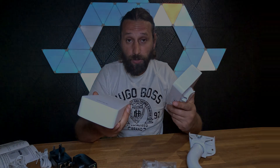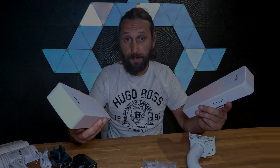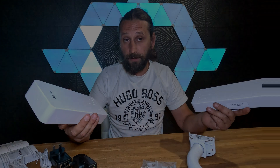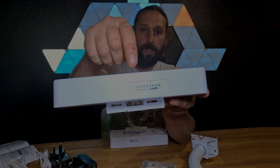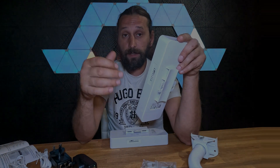We are going to try to install them and see how easy it is. One thing to keep in mind: it's always best for the antennas to have line of sight to each other, because if there is a wall in front of them then the stated range of over two miles is going to decrease. On the side you have some LEDs that show you what is happening — what is connected and if everything is working fine.